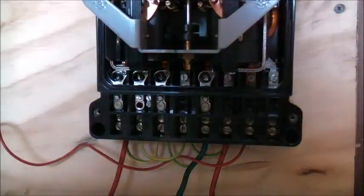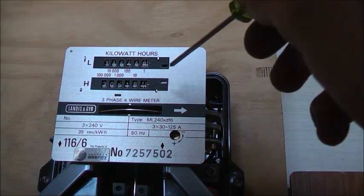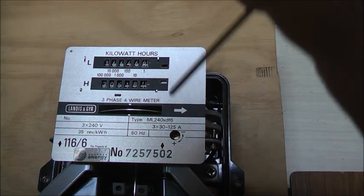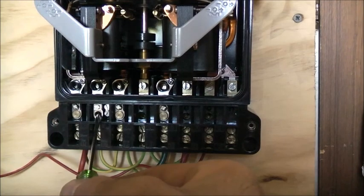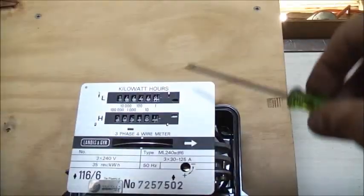Now, if it was just all wired up and ready to go — it actually already is on that rate. I just wanted to verify and make sure which rate it was on, and double-check where this actually connects to. So this one here is our live for our solenoid — that there potentially goes through that, through a switch to neutral, to switch the tariff change mechanism over.